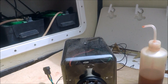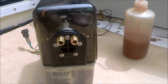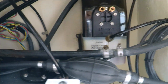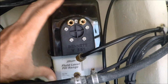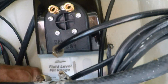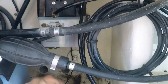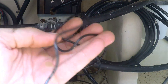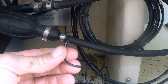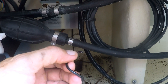We can pull these rubber caps off as well — there are two of them on there to protect those fittings — and then this piece just slides off. I'll put the screw in the top of it and set this back in place. Got the unit back in the bracket, got it fully screwed down with four screws on the side, all tightened up and sitting in here. All I have to do now is plug up to the main harness, but first I'm going to feed my ground wire through back on the transom, then make a connection for the end of the wire to put on the battery.